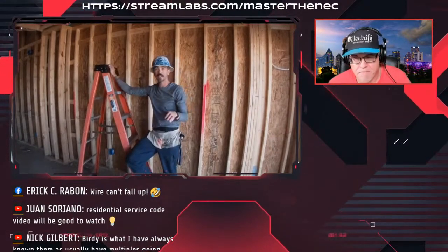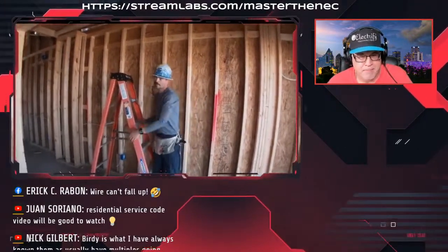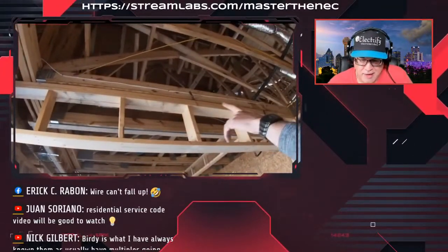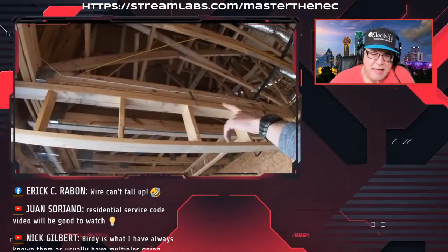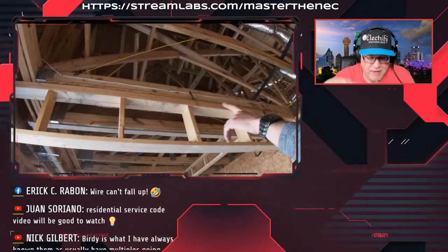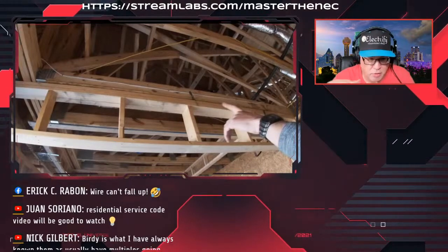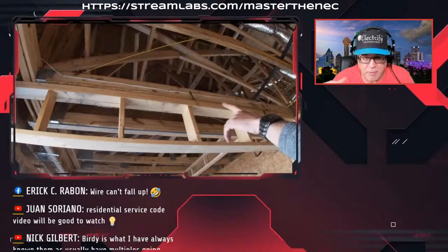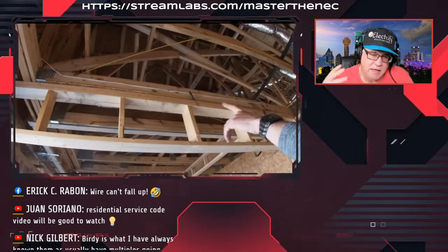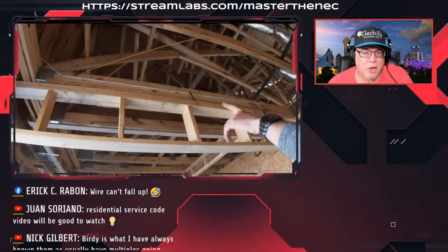As long as it's nice and tight and you're going across the trusses in a certain way, a lot of times people won't notice it if it looks good. But see, if you're going long ways against it, there's no. I noticed the comment, Eric says, wires can't fall up. It's got nothing to do with that. It's the movement back and forth. They still can move. You've got to secure them in place. It's not about falling. It's securement, so they don't move, if people are climbing through and kicking them around and moving them around. That's the reason. Plus code is code. So we have to do what the code wants.